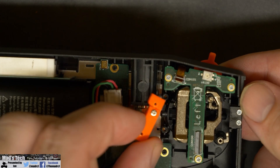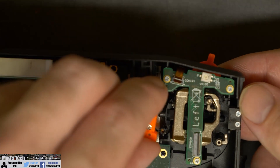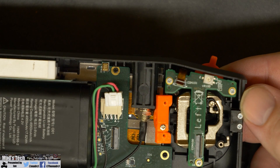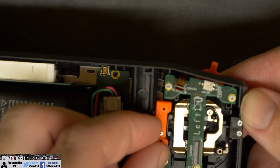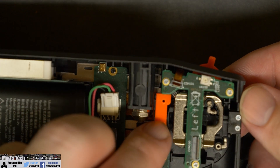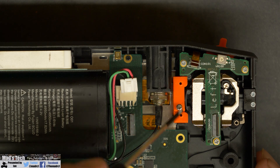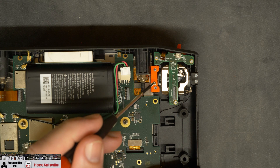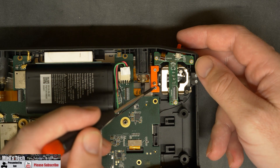Once the spring is removed we can fit the new 3D printed clamp assembly. This goes on one way with the little notch going in towards the gimbal. You simply push it over the shaft, place it down into the hole, put the gimbal back into the hole on the right hand side, gently wiggling it until it goes in. Then put a little bit of pressure on to make sure it's in place and put the two retaining screws back in to hold it down. You've got the two clamp screws in place with the adjustment screw located next to one side. This will tension how loose the gimbal is and you can adjust it to get the feel as you like it.